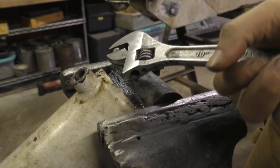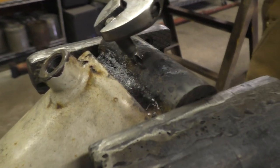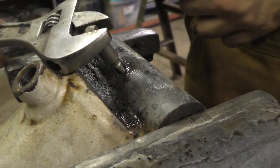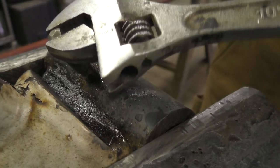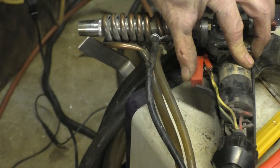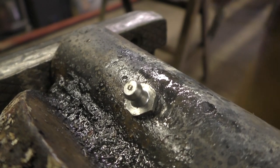And we heated up the steel on this piston to drive the pin out of it, and we probably hardened the steel up, so it's making this tapping for a zerk a little more challenging. So a brand new tap, sharper, and seems to be getting deeper, doesn't it? Yeah, a lot better. Okay. All right. Sharp tap for the win.